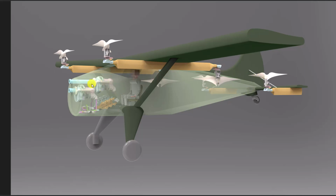This plane was created by de Havilland. It's now owned by Viking. Viking stretched the nose of it. It may be that these 2 Rolls-Royce Allison 250 engines can be moved up. They're 600 horsepower each, so this is a 1,200 horsepower plane. It was initially set up, the plane weighed 3,000 pounds and it could carry 2,100 pounds of fuel or payload. Combined takeoff weight, 5,100 pounds. Viking, who now owns it, took it from de Havilland and brought it up to a takeoff weight of 6,000 pounds.